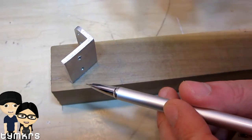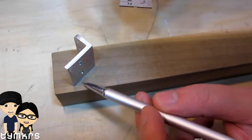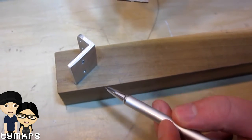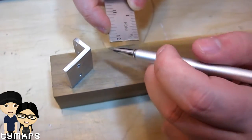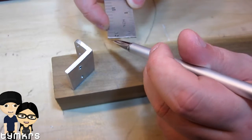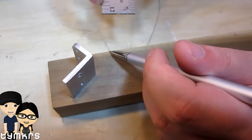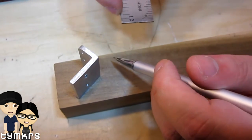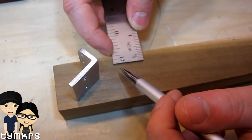So Whisker, how do you know where to put the tailpiece in relation to the rest of the box? We wanted it at an angle here. Yep. And it needs to be thick enough for the screws that come through this to have something to go into. And the top of the box is 1/4 down from the top of this board. This board obviously won't be here because it's the material we're removing. But 1/4 inch down from that is where the top of the box is.